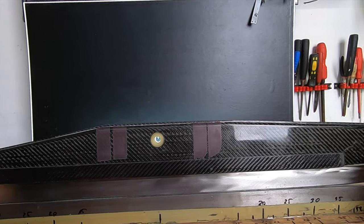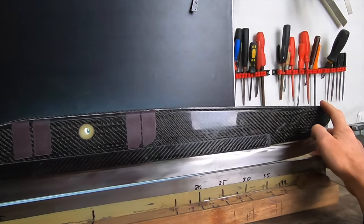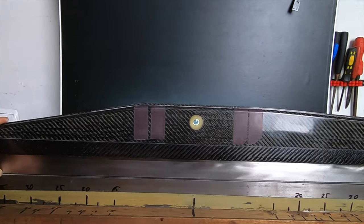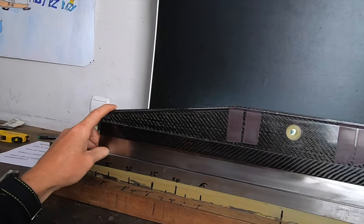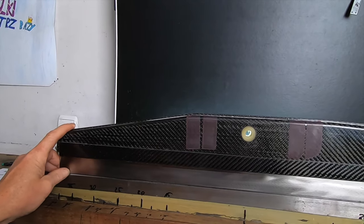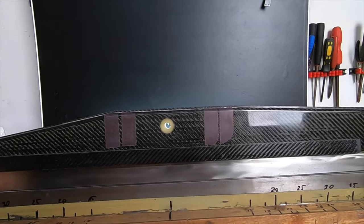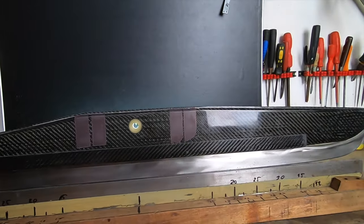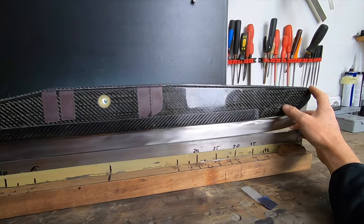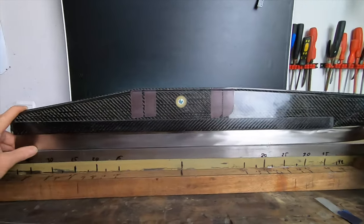And then you start to lift the back part of the runner to the front and just check the smoothness of the crown. Make sure that the runner doesn't have any bumps, because sometimes it happens that the runner might have big bumps, which is not necessarily very fast. So that's it, 25, 25. This is a medium runner, if you consider the straightness of it.